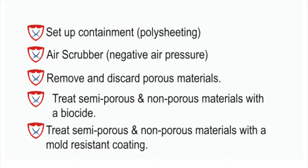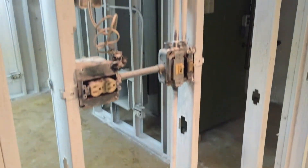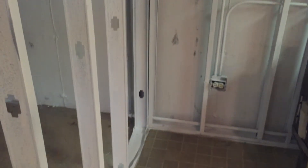We'll take a look at some footage after the basement is completed. As you can see, we pulled up the flooring and got all the drywall, trim, and insulation cut out. In this basement, while there were several areas where the mold was very low on the wall, there were several sections where it came up much higher. We classified all affected surfaces by material and tackled the project accordingly — removing all porous materials and treating everything with a biocide. Because of the severity of the mold growth on the drywall, we also decided to go ahead and scrub the steel framing down.